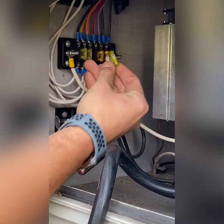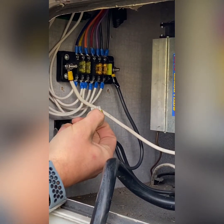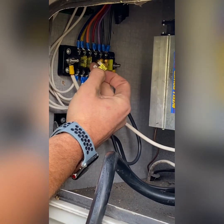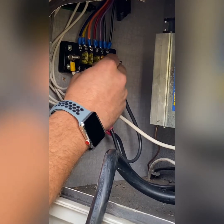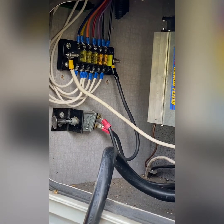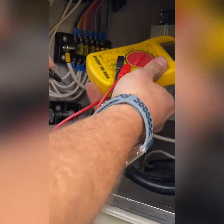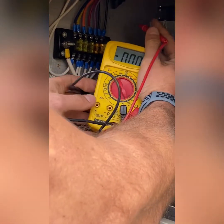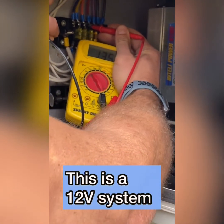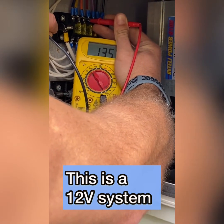I'm going to pull it out and inspect the fuse to make sure there's a connection. This fuse is not blown — it's in good shape, which makes sense because the pump was running. If it was a blown fuse, since these are 20-amp fuses, you'd switch in a known-good fuse into that bay to confirm it wasn't a fuse problem. You'd also want to check that the orange wire is getting power from the fuse bay. Grab your voltmeter, turn on the DC, touch your main neutral and the screw the orange wire is on — it reads 13.5 volts, which is good because the batteries are currently getting charged.